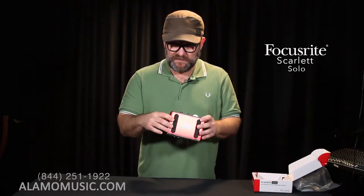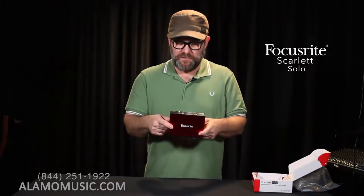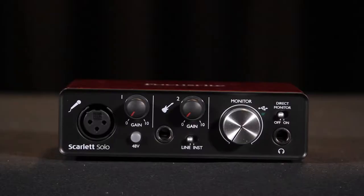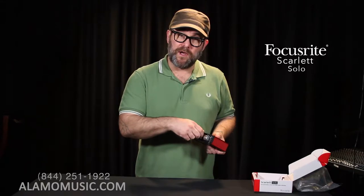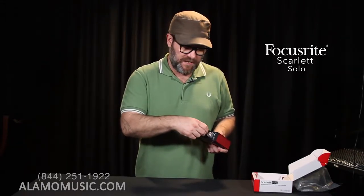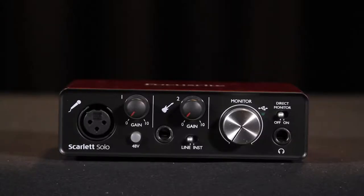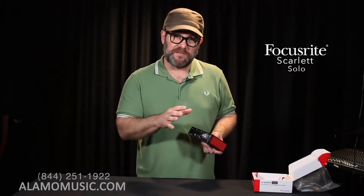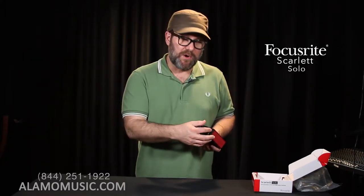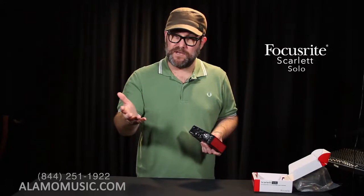This one is particularly small — it is the Scarlett Solo, so this is going to fit into your computer bag or your backpack with great ease for portability, so you can record on the go pretty much anywhere. The front of the device has one mic input and one instrument or line input which is switchable, so it's a true Hi-Z input if you're a guitar player. You have separate gain controls or pots for each input as well as a monitor control and a headphone output. The monitor can be switched to direct monitor, feeding the input directly into the output without going through the computer, so you won't experience any latency. Even without that, the latency is very, very low, though that will also depend on your DAW setup.